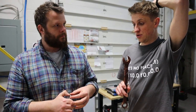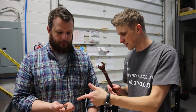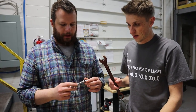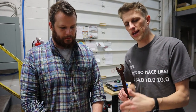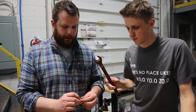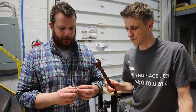I'm super excited. I'm not going to give any time estimates as to when we're going to sell these things, but soon — weeks or short months anyway. It should be soon. We should have like 10 ready soon. It'd be nice to make 10 — you're making 10 parts now and you know they're going to be good. We have some from before, like tips that are probably good from last summer. Then we'll dial things down. These are all time-consuming parts — the sleeve is eight minutes on the machine. We can cut some time from that, but that's what you do: you make it how you know how to make it no matter how long it takes, then you pare it down. Custom tooling — like the key seat cutters — that's going to save a lot of time. We make it with what we know, inspect it with the equipment that we have, and moving forward we know what inspection equipment and tooling we want.